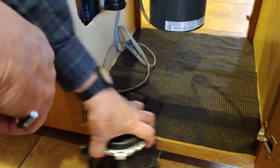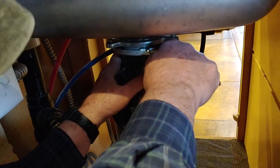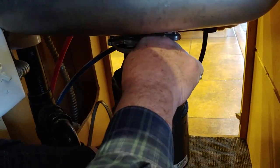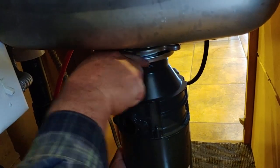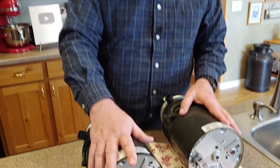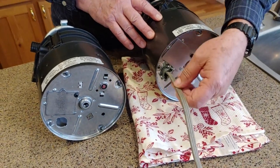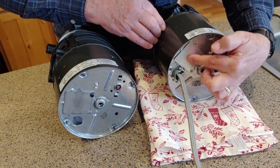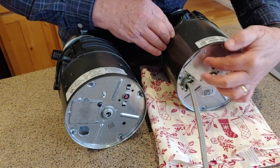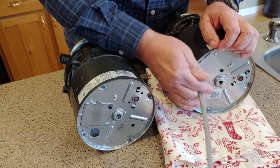Let's reach up in there with the wrench, put it in one of the rings, hold onto the bottom, and rotate to the left. I can feel it moving — support the weight underneath and there it goes, the whole unit. Now we've got the two units side by side — old one and new one. The goal now is to harvest the old power cable: remove the access plate, take out the terminals, loosen the Romex connector, and get that out.